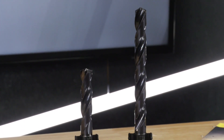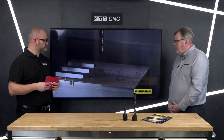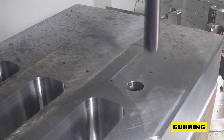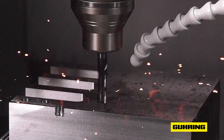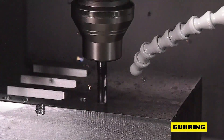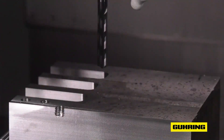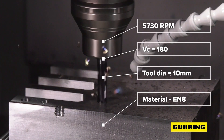The other thing I note is how lubricant and how shiny that coating is — is that a big part of it? Very much so. You're looking at swarf evacuation first and foremost; you can only drill at the speeds that you can see in the video. We ran this dry, simply because you normally wouldn't — the whole range is oil feed, but obviously you can't see anything on a CNC machine if it was running with coolant. With that particular tool, swarf evacuation is paramount — you can only drill as fast as you can get the swarf out. So the surface finish requirements before coating are very high, and the polishing after coating is also very high.